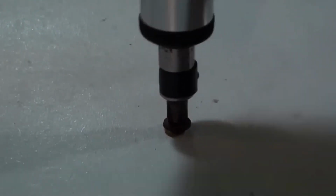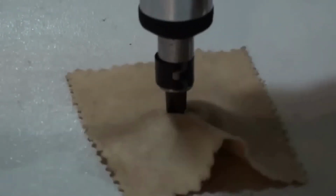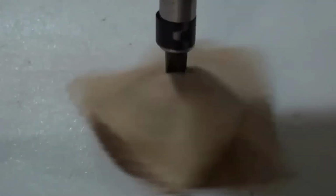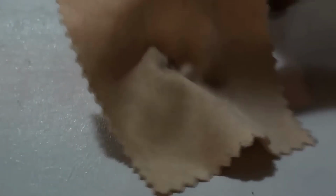What to do when the cross screw is stripped and is already totally inside. I had already put a similar video that I will leave a link to in the description, but not with the screw totally inside. In this case, we can do it in two ways. We can put a fabric on top, of those used to clean phones that are not very thick, since the screwdriver would not reach the screw. And we try to unscrew, since this will make the little slot that is still there grip. It will not slip and we can get it out almost without problems. As you can see on the screen, the fabric is totally marked, since that is what is allowing the screwdriver not to slip.